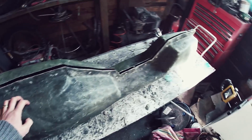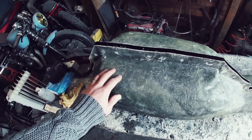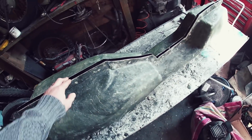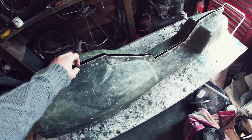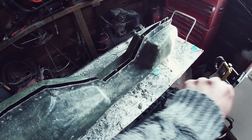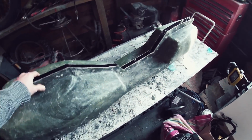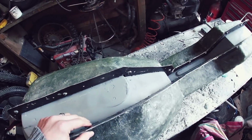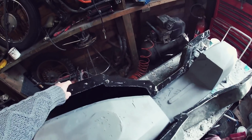Here's the final thing. Here is the final mould itself. So, split mould, straight down the middle. It was, I admit, a bit tough to part this because there were bits where release wax wasn't doing its most perfect job, but it's there. Drill holes all the way around, neatly cut, and this is it. One piece, and the other piece.